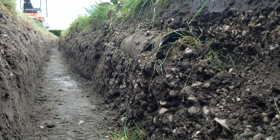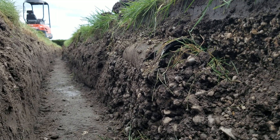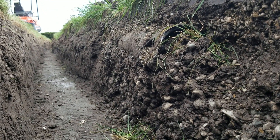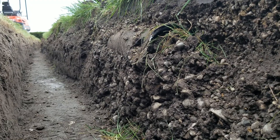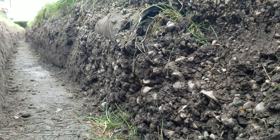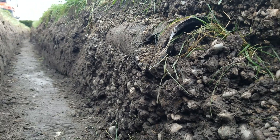I'm always talking about how you need a geotextile non-woven fabric to act as a soil separator from your stone. Here's the perfect example. We've been contracted to put in a new French drain. The old French drain quit working. You can see that the stone migrated into the subsoil, the subsoil migrated into the stone, and the system failed — it plugged.